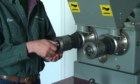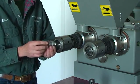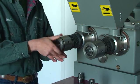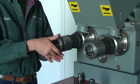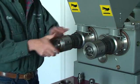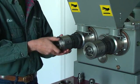The jet is the final part of the screw assembly — it's just the jet where the grain actually extrudes out. This is the press head component. There's a jam nut on the end which will come right off, and we just loosen up this jam nut so that we can move the pre-jet, which is this portion, in and out as a fine adjustment. This pre-jet will come out as well from the press head assembly.